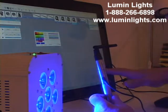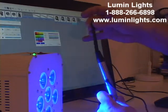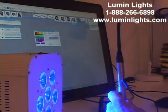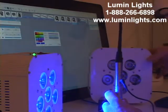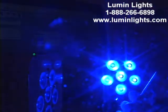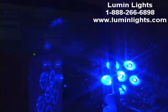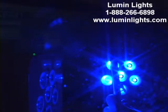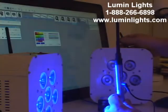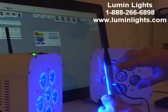From your DJ or band station with your computer running your program and your DMX stick broadcasting, all lights around the room receive signal. Adding a second light set to the same channel — it starts blinking green and both lights match the color. One stick can control as many lights as you want, whether five or 500. They're all listening through their antennas for a signal. Put everything in slave mode, use one transmitter from your controller, and you'll have no problems. If they lose signal, they simply go dark.